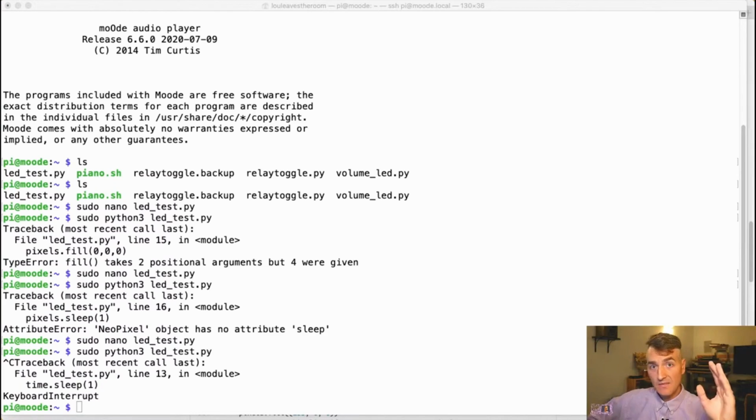So I would like to automatically reduce the volume when there's no sound, when the amplifier is off, so when I turn the amplifier on, it doesn't pop, and then return the volume to its previous state. I also want to just control the analog volume of the amplifier with the volume knob. I think that is the expectation that people would have when they use an amplifier. When you turn a volume knob, you expect it to control the hardware volume of the system. So that is what I'm going to implement using digital potentiometers.